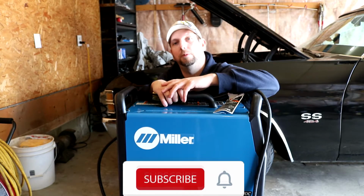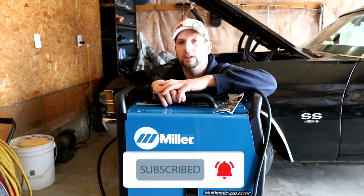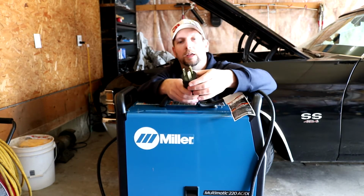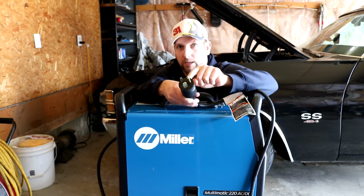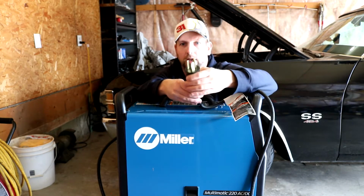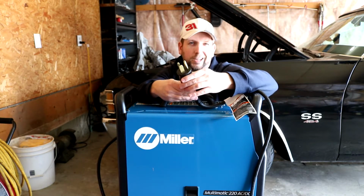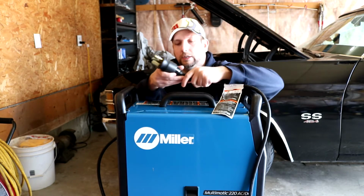In today's video, I'm going to wire up an outlet for this big boy, the Miller Multimatic 220 AC/DC welder. And as you can see, it comes with a large 50 amp 240 volt plug-in. It does come with a different plug-in head that you can adapt it to 110 volt. But from everything I read, 240 volts is the better way to go, and in some cases required.